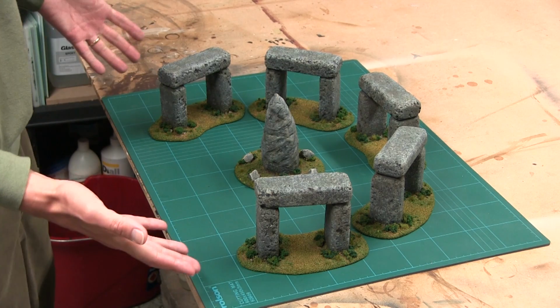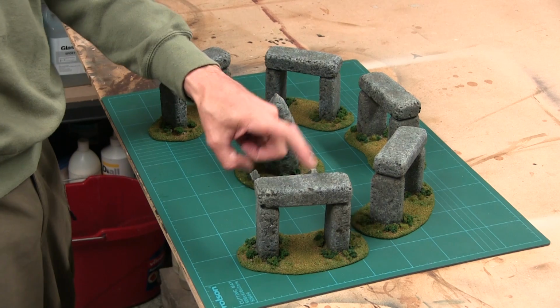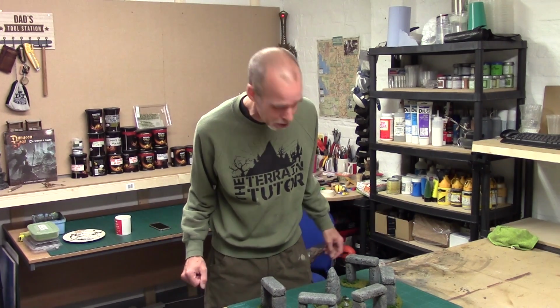So with the sealing done, that's them all done, and they are looking beautiful. Now, quick couple of caveats. Obviously, I've struggled a little bit with the expanded polystyrene here, mainly because I was trying out Artex as a covering. The Artex is a lot tougher than my general filler, but it doesn't have the volume to hide the bobbly bits. So, I'm in a bit of a quandary. If I was to do it again, I'd probably fill the bobbly bits a bit more with filler and then use the Artex. But that's me going overboard as usual, guys.